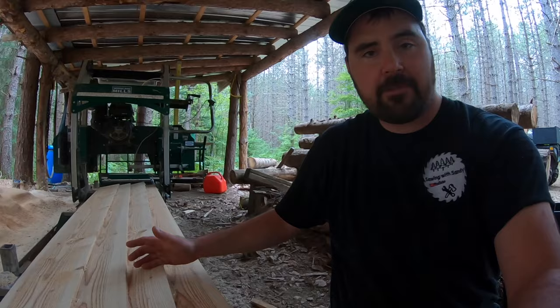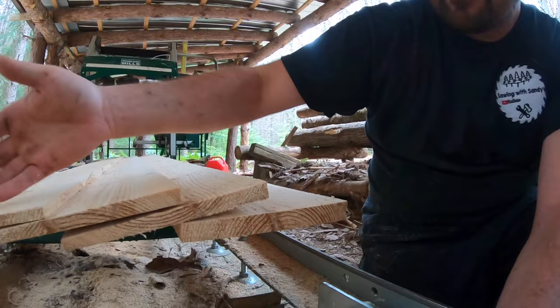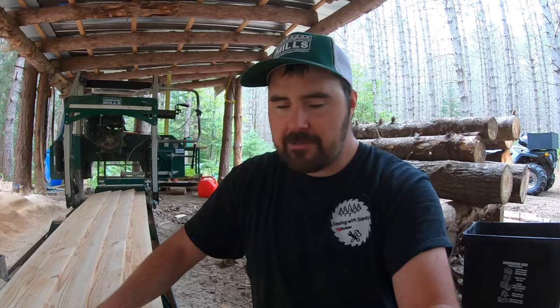In my case, I went thin here, so I went narrower. Here I went wider. For you, you may decide to have this, you may decide to have this. For me, I'm deciding to have this here in the middle. This will be the profile that I like. Therefore, I'll remember what the particular notch is on my indexing handle, and I'll also take note of the height adjustment I made each time. In my case, it was half an inch.